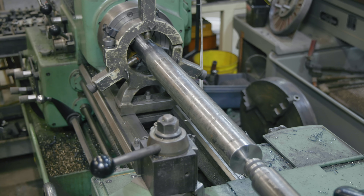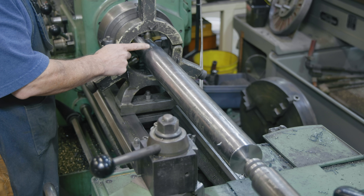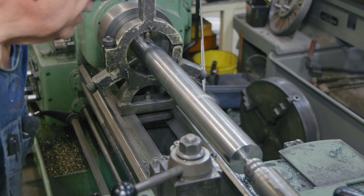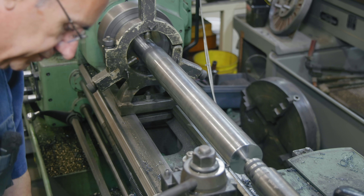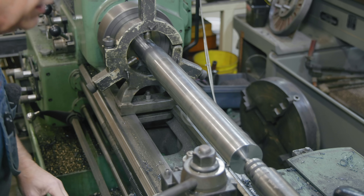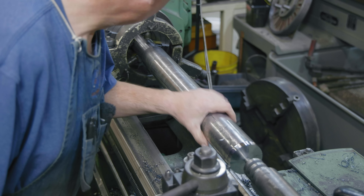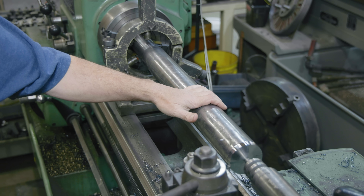We need to cut down all the way to within a half inch. This has a little half-inch collar and the diameter needs to be 2.505, so we've got about a half inch to take off. Let's see how she cuts. I'm just going to do 50 thousandths again. That does not like that, so I'm going to change this insert back out and put the other one on that was working better. It may be because I don't have any support in here. Let me swap that out.